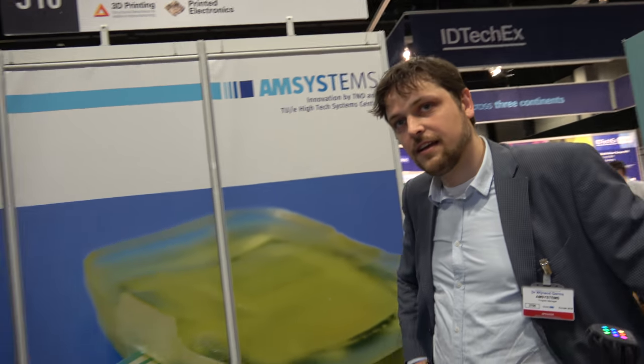You have a big machine that can do this? Yes, we have. The machine is not here. But we have a movie online with a large stereolithography machine that we developed. This platform is made to do multi-technology manufacturing — combining it with extrusion, post curing of conductive tracks, and pick and place. One stop: your whole digital design goes in and the final product comes out.